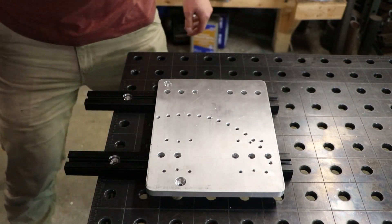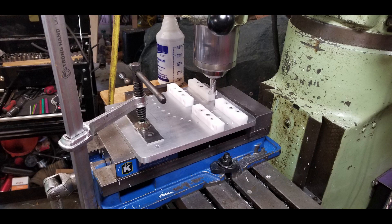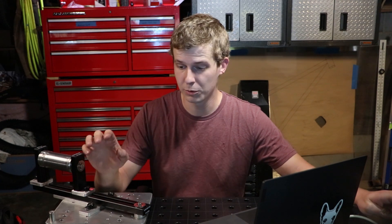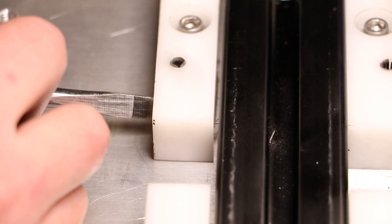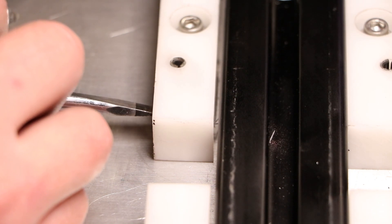When I made these bearings, I actually made them a bit oversized and left the reference surface of the reference bearing unfinished. This is so after assembly onto the angle plate, I put the whole thing back onto the mill with a fairly simple setup to make the final cut and just take the last few thousandths off and make sure everything was squared up. It is worth noting that the spring plungers used for the axle holder are a higher force than the ones used for the angle plates on the head tube and seat tube, and that's all detailed in the drawing package.